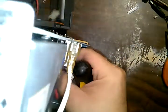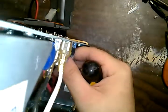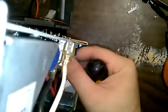I want to reiterate here on battery safety a little bit. What you do not want to do with these is use a car battery. Your typical car battery is not a sealed battery. I mean, you can use a car battery, but it's highly recommended that you not use a car battery inside your home, especially if you have open flames or things creating sparks, because car batteries, while they're charging, off-gas hydrogen. Hydrogen, as we know, if you remember chemistry, is highly flammable, explosive if it's concentrated in an area.